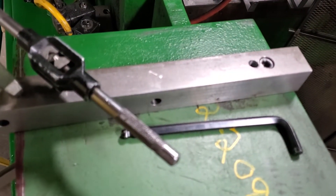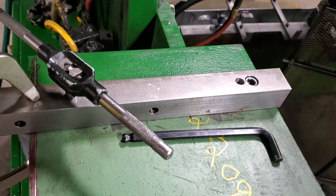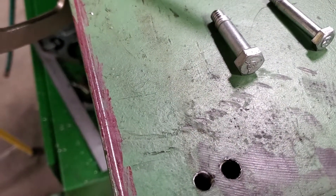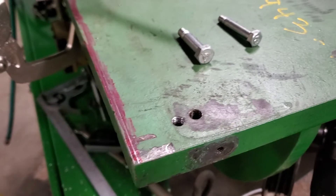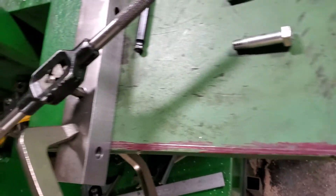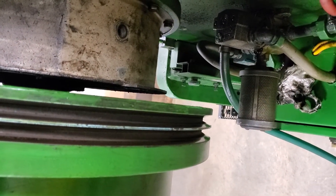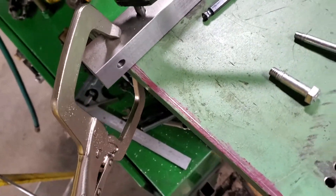I'll show you how we decided to make new holes and make them accurate. I used a template and stepped it up from quarter inch to 5/16ths to 3/8ths. The reason for it is a quarter inch is easy to drill through a 1-inch plate. We should back up — you'll see a scribe line on this plate that is directly in line with the back side of the flywheel.